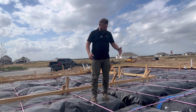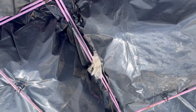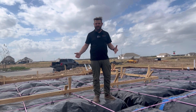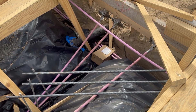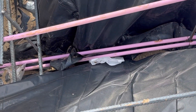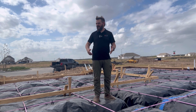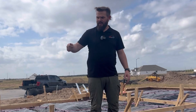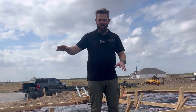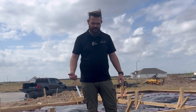Another thing — just about everywhere I look at the excavations in the beams, there's garbage. The wind is blowing terribly, so it's probably blowing some things around. But we want to bring up that there's trash in these excavations because we want them to get it out before they pour the concrete. We don't want trash in our foundation — I go through sometimes and find bottles and things embedded in the sidewall of the foundation. Let's get all that stuff out of here before we pour.